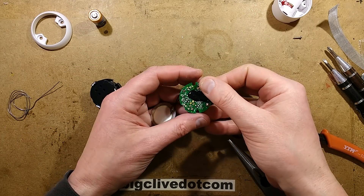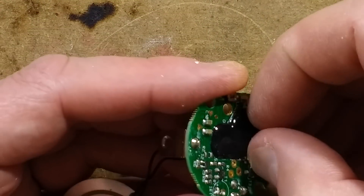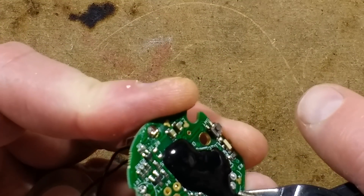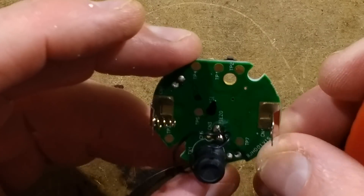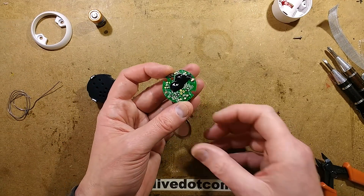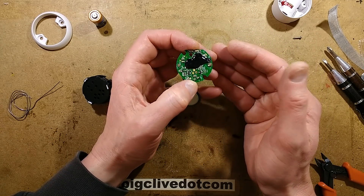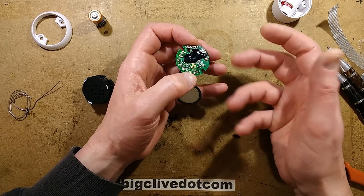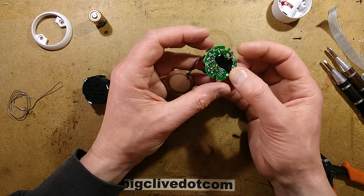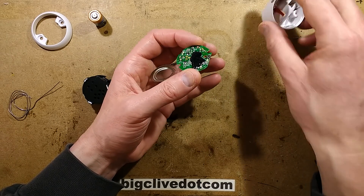Let's take a closer look at the back of the circuit board. Sadly it's really just fundamentally a blob of resin covering presumably multiple chips. On a double-sided board you can't see the outline of the packages underneath, so I'm guessing it is just multiple chips under there. There does seem to be separate gain circuitry made out of modern discrete components, a little click button inside, and a little side-emitting LED for the test function.